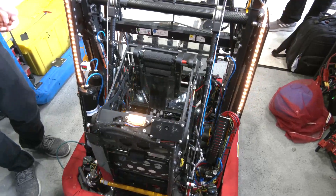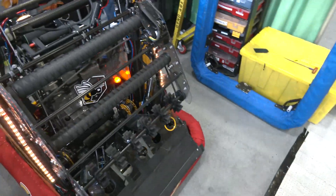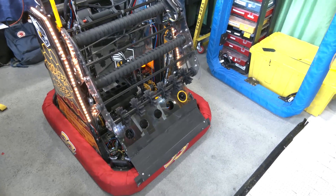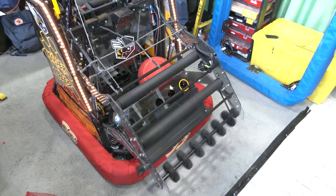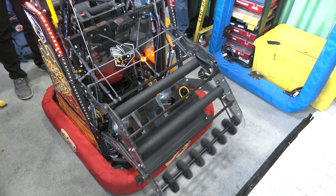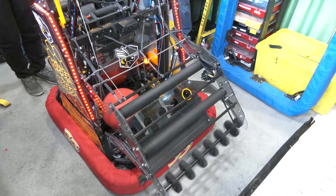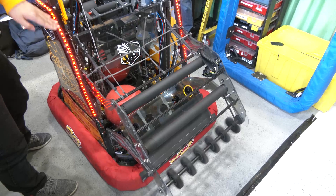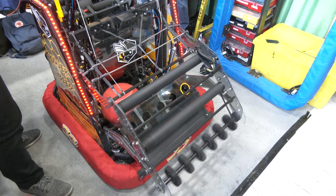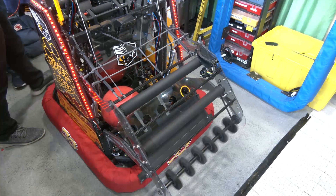Can we see the color sensor demonstrated? Part of the color sensors is we want drivers to know what's going on. Going ahead and enabling — a red ball is fed in, settles on the left side of the robot, and auto-cues right into the infeeder. The banner sensor stops the ball and stops the infeeder motor. We have red LEDs on top for the infeeder and LEDs on the bottom for ball presence, so the driver knows what color balls are in the robot and whether we have one or two balls ready to shoot.